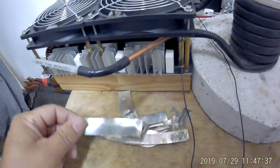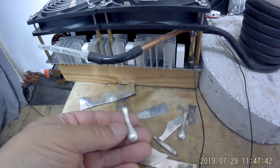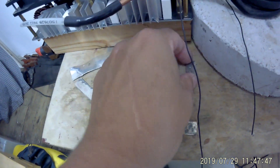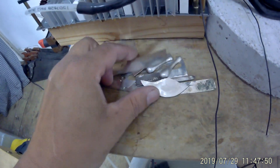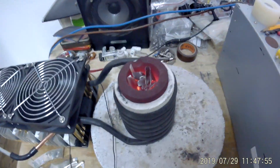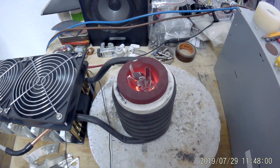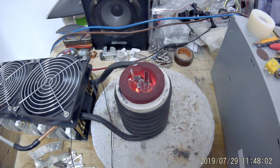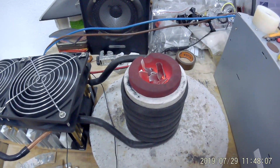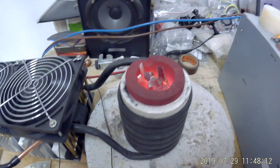This is what I do — I use bits of scrap silver off old milk jugs and things. There are some legs off one there, and other bits of silver that I can get from anywhere to make jewelry with. She's well glowing already now and it's four minutes. I think we timed it last time — it was less than ten minutes before the crucible melted. But as you can see, the top of the crucible is hot at the same time as the bottom, whereas before it was heating up only at the bottom.